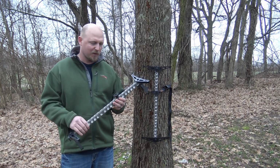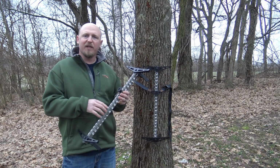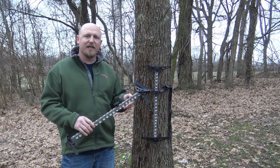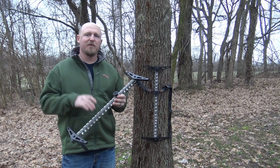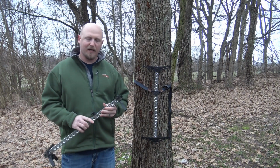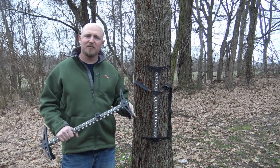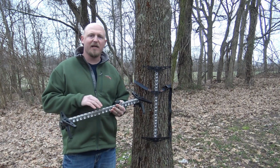It's not the prettiest in the world, but I will say this: for you guys who think that you don't need the countersinking, I'll go ahead and tell you, you're going to have to do it. Use a 3/4 inch drill bit, about 2.5 seconds on there. It'll make a perfectly nice cutout hole. Each stick as I did, it got better, so take your time if you want to drill the holes. I personally don't think you're really gaining enough by drilling the holes.